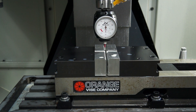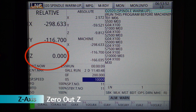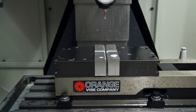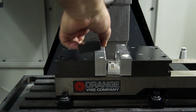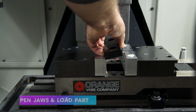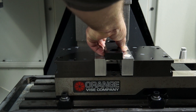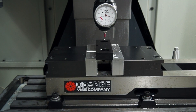Keep in mind you could also do this on a manual milling machine with a digital readout fitted. If you're using your CNC machine, keep in mind that you could get some inaccuracies if you have backlash in the ball screws, unless your machine is fitted with high resolution glass scales. Keep in mind that this technique I'm demonstrating today is just demonstrating an alternative way and not a definitive how-to guide.